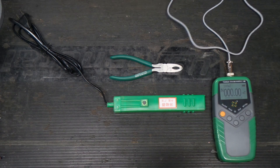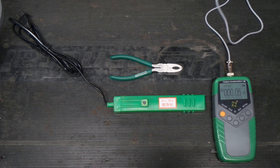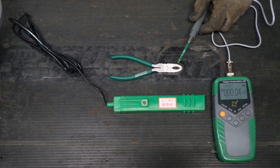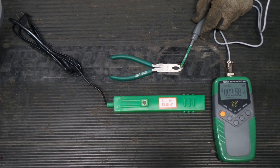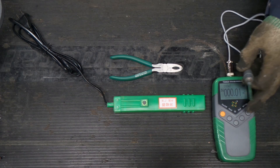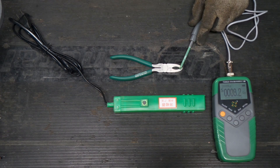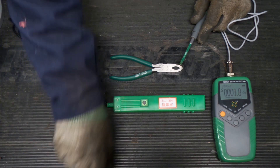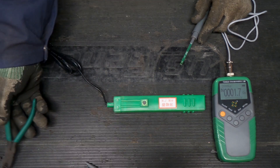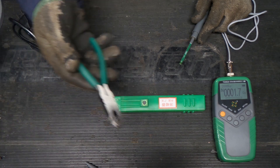To see how magnetized they are, we have a digital gauss meter — or millitesla, depending on how you want to say it. You can see on the scale this tool is showing that it is indeed magnetized. That is quite a bit of magnetism — it's enough that if you get the tool near shavings it picks them up, and that is very, very annoying.